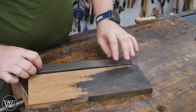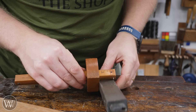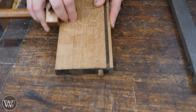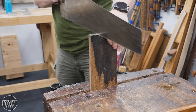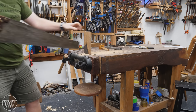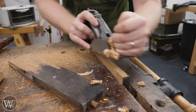We're going to use some 100-year-old quarter sawn white oak to replace a press board pine leg. I have the original here and this stretcher is about that wide. I'm going to take this piece of scrap 100-year-old white oak that I pulled out of a dresser that was falling apart. It happened to be exactly the right length I needed, so I just needed to rip it down and put the tenons on the other end and hope they fit into the existing mortises. We'll cut one end down, plane those two edges smooth, and get two stretchers out of this one piece.